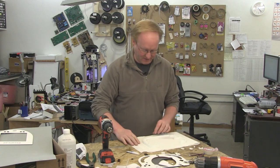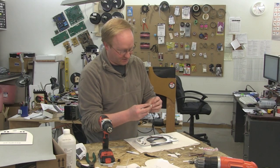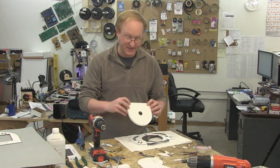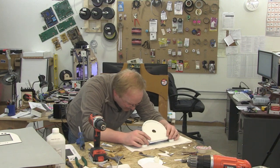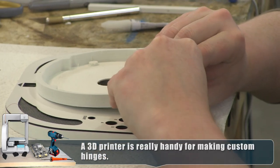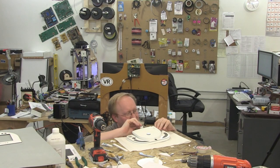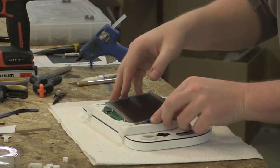I have more parts routed now. This is the layer one frame that's going to attach to the other layers, and we'll also attach the latch for the lid. I'm going to attach the screen portion next — I'm not going to enclose it until I know everything works. There are holes in it to receive the springs, and hinges in the back. One half of the hinge goes to the bottom and one half to the top. I want to get some support in the back using a crossbeam, but I don't want to do that until the hinges are in place, in case I need to manually trim for inaccuracies.